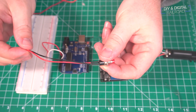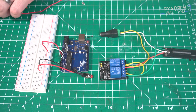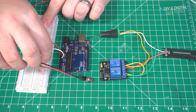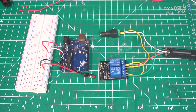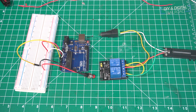We're going to connect the other connection from the second relay's normally open position — the right hand terminal — and connect it to the other screw terminal on the snap switch motor. We're going to wire up a momentary push button to control the snap switch, and I will have a schematic of these entire projects in the description below. Connect the 5 volt power to the button via the red wire, and the black wire is going to be our ground. We're going to use a 20k resistor to jump from that black wire to the ground connection, giving us enough resistance to be able to read the button. Then take another wire from that black wire directly into digital or analog pin A0. So the button is connected: red 5 volt to black, which is split between going to A0 and going to the ground connection with a 20k resistor.